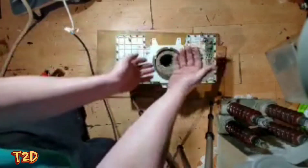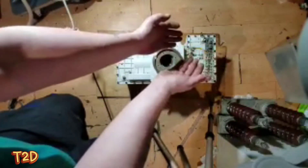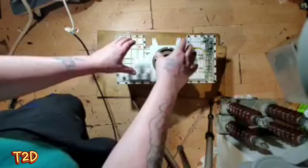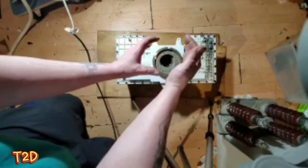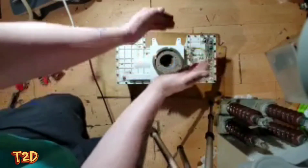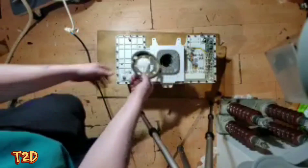We've just unbolted this flange - this is where the collimation section actually attaches. The collimator just has X and Y plates made of lead to narrow the beam, so only the portion of the patient that needs to be x-rayed gets the beam. If you want to x-ray a small area you just close up the collimator, narrowing the beam and limiting the exposure.